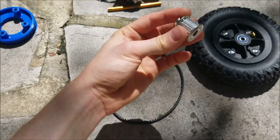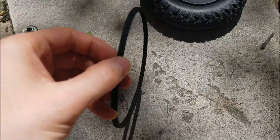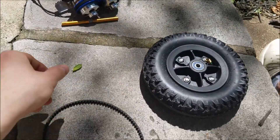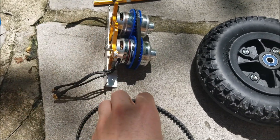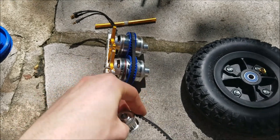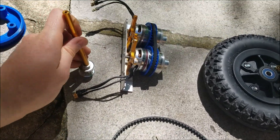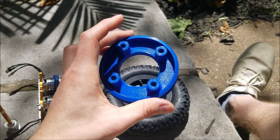Some sick new parts arrived in the mail. I got myself a metal drive pulley for the motor and a super thin belt — you can see how thin it is. This thing is going to be super narrow and fit between the wheel and the frame because I really only have about five millimeters. I'm going to chop this pulley off with a hacksaw and shorten it. The only bore I could find was eight millimeter, so I'm going to use this standoff material to adapt eight millimeters to five.